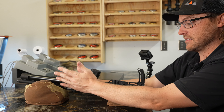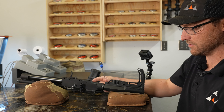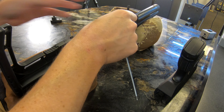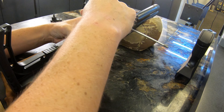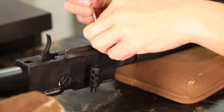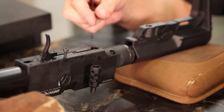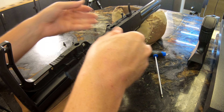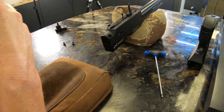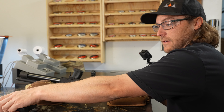I have all four of them loose. On the bottom left screw you'll notice it has a little bit of pushback to it — that's because there's a spring underneath there. So I always take quadrant three, or back left, whatever you want to call it — I take that screw out and everything else will slide up. Then where quadrant three was, you just want to put that screw back in there because there's a spring and a ball detent in there for your power adjuster. I always go ahead and just cap it back off — right now it's just acting as a plug. Believe me from experience, you will lose that ball detent and you will never find it. So go ahead and cap that on right there.